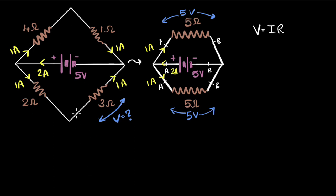Now I know the currents everywhere. My goal is to find the voltage here — and I can, because I know the current. Using Ohm's law: voltage equals I times R, one times three equals three volts. That's the answer. I can also find the voltage across the other resistor: one times two equals two volts. And two plus three gives you five — exactly the five volts that got split as two and three. Makes sense!